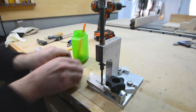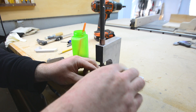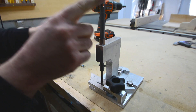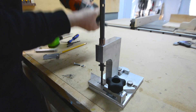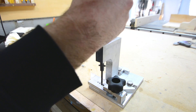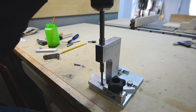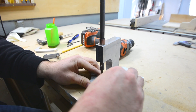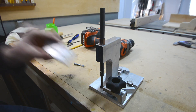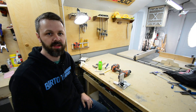I made this little handle to do it by hand, but I'll probably never do it by hand because it works just so well with a cordless drill. Take this off quick and easy, move this over to the next hole, lock it down. Now I could put flats on this, but I chose not to because I'd actually rather the drill chuck slip before it broke my tap. So I'm going to keep it just round like that. Put it in low gear and you're good to go — just like that. Works pretty awesome. All right guys, that's it for this week. I hope you enjoyed this as much as I did. Until next time, I'm Ryan Nodwell. Thanks for watching.